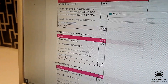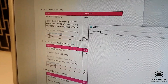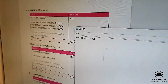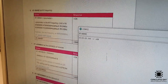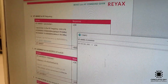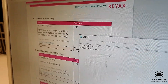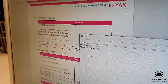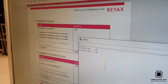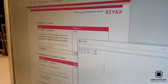For address, we are going to use the AT+ADDRESS command and assign whatever address we are interested in. I'm going to assign address 0, and here you can see the serial response is okay. That means we have successfully assigned the address. For the band, we can assign different frequency bands — in my case, 915 MHz. You can assign a different frequency band according to your allowed band of frequencies in your country. In this way, we successfully set the parameters of our first module. You can also set the second receiver module's parameters so that it can communicate on the same band and over the same address.